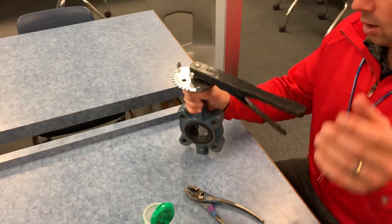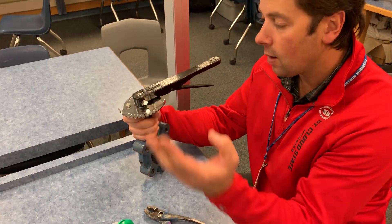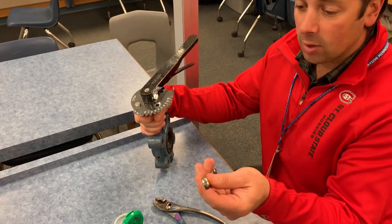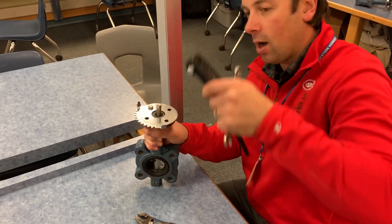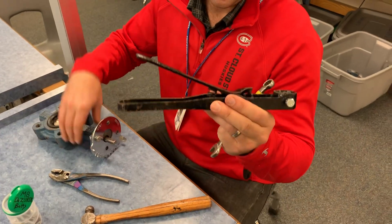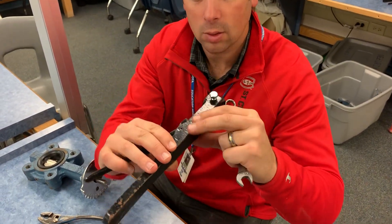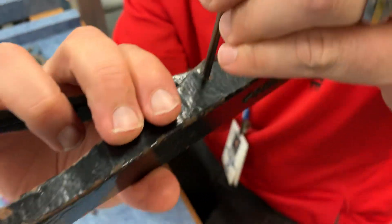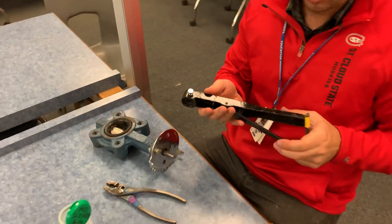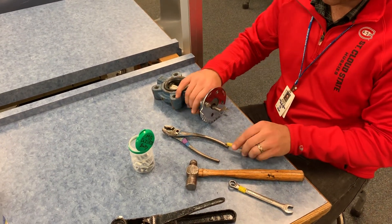I'm going to go through the process of disassembly here. First, the fasteners — figure out what style and size they are, metric or standard, specifically the thread pitch. Find the right wrench for the job, loosen this set screw nut, and slide the handle off the top. The handle stays as a sub-assembly because the handle, the releasing lever, and the spring are really difficult to get back together once we punch this roll pin out. This is a roll pin, so you'd drive it out with a drift or punch. But getting it back together is difficult, so we leave this as a sub-assembly and set it aside.